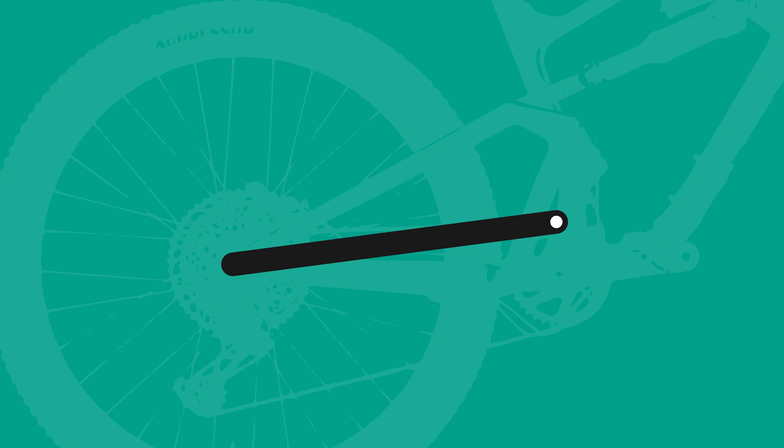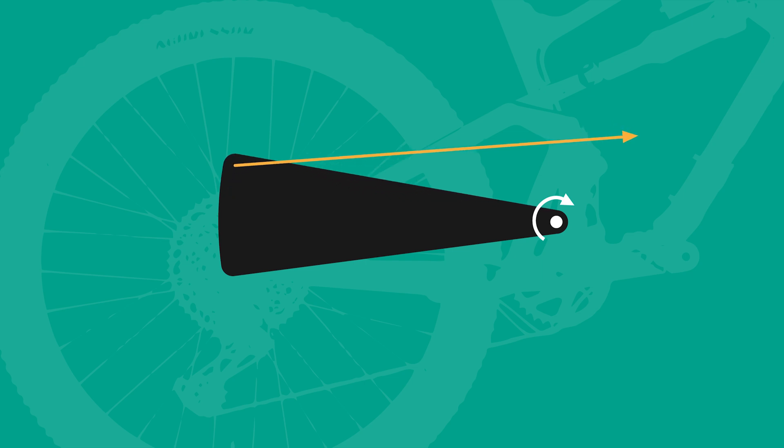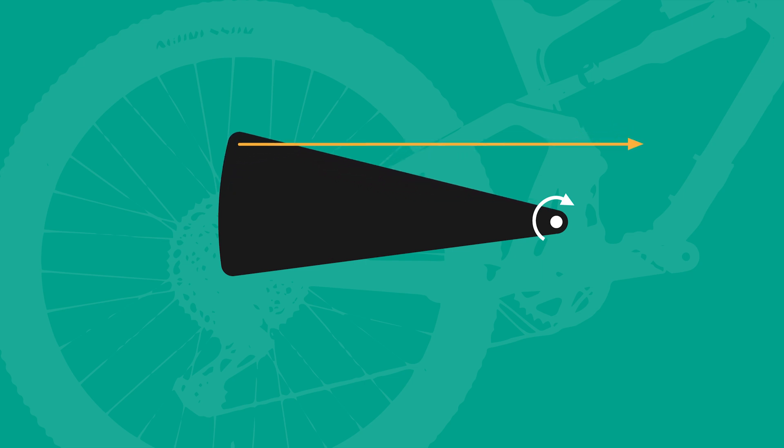Imagine I had a stick that was nailed to a board. If I applied a force at the end of the stick directed through the nail, the stick wouldn't move or rotate. If I now redirected the forces such that it was above or below the nail, then the stick would rotate accordingly around the pivot nail. Now imagine I expanded the stick to be pie-shaped and applied a force horizontally. The pie would still rotate, but if I redirected this force through the pivot nail, the pie would again cease to rotate or move.